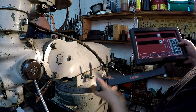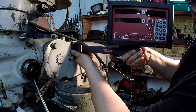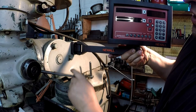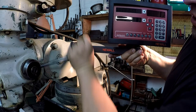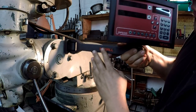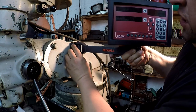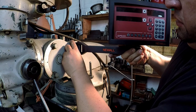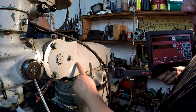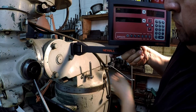And one of the things that you look for is, make sure that your quill handle is going to clear. So that gives you room to get your hand in there whenever you're cranking this quill and you're not smashing your hand on it. If you was to put it right there, see? So if you mount one of these up, just pay attention to that. I think that area right in there is going to be pretty good because you start curving out right about there and down here. So we'll put it right there.